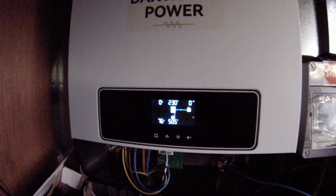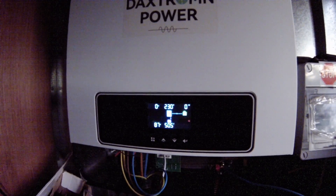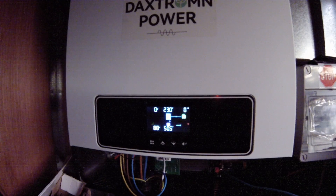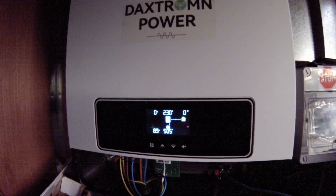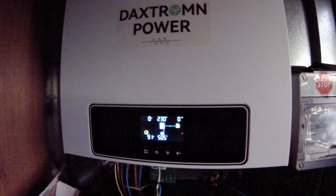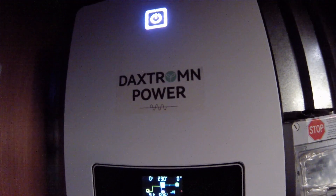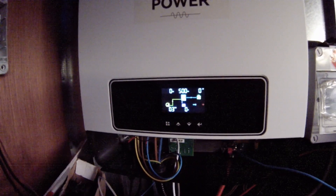We have a little bit of solar now — 76 volts. I think 90 volts is the startup threshold, though I can't find documentation confirming the startup voltage for the MPPT. At 90 volts it stops flashing, which seems to be that startup voltage, and it changes from red to purple indicating it is now charging.